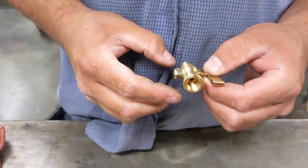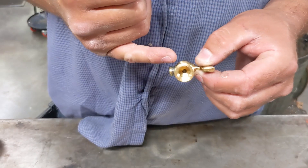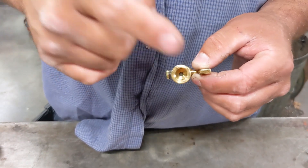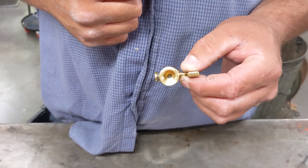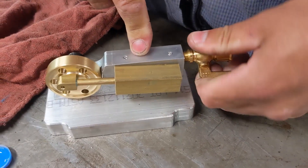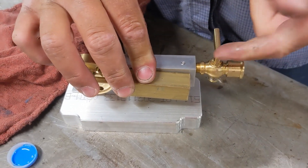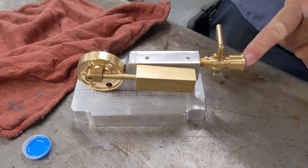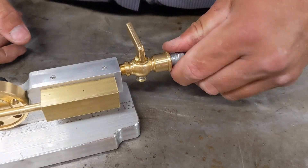This is the air cock, which is the throttle for your engine. In the assembly process, they end up with a tiny bit of grease on the inside, and the grease is actually sticky, which will slow your engine down from running correctly. I recommend before you install this in the engine to just blow it out with an air hose — give it a blast of air, it'll shoot the little tiny dot of grease out the end of it, and you'll be good to go. Simply install it in the end like so; basically just hand or finger tight is more than enough. Install it so the lever is up top like this and you can easily regulate the speed. Now you have an assembled engine — install your air hose fitting in here, and you're good to go. We'll install our air hose fitting right in the end like so, and then we can hook up our air hose. They don't take a lot of pressure.